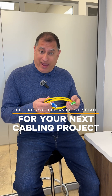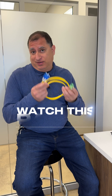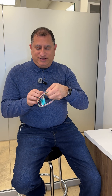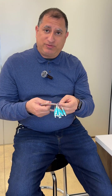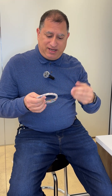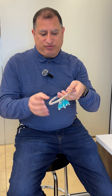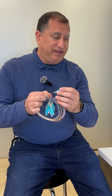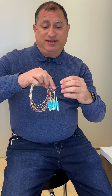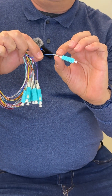All this talk about fiber and how thin it is, like a hair of glass — let's take a look inside. Here it is. This is what's called a pigtail, so basically this is what we would fusion splice to the cable coming in from the outside. You would take these thin strands of fiber and fusion splice them — which we could talk about in another video — to the glass coming in from outside. You can see how thin this is, and this is actually even thicker than what's underneath, because this is a buffer around this cable.